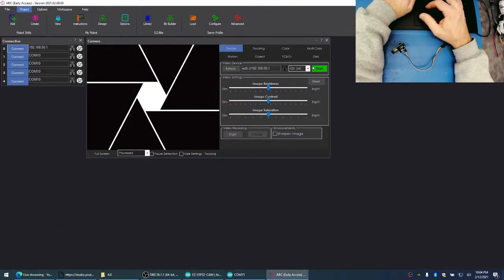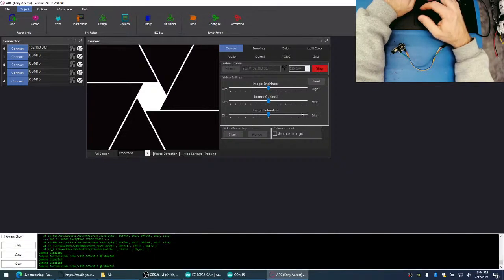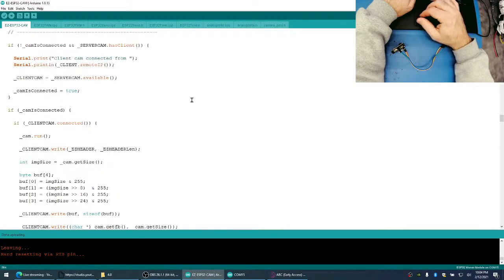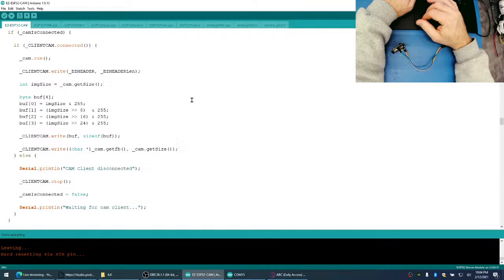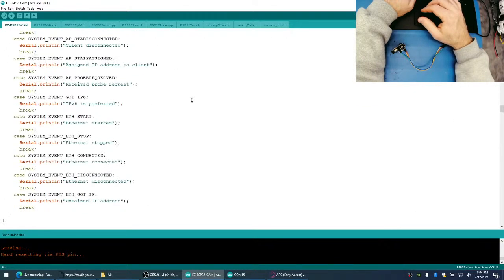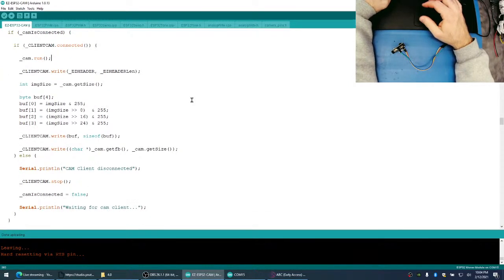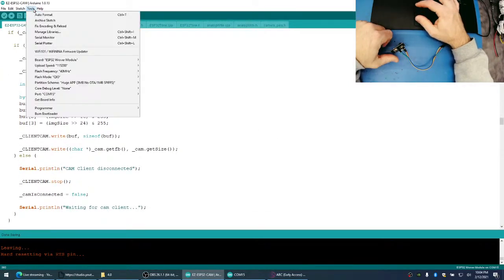It's 133 megahertz, and it's got 264 kbytes of RAM and 2 megabytes of flash. 3 analog ports, 26 GPIO, 2 UART, 2 SPI, 2 I2C, 16 PWM channels, and USB. I don't know what happened here, guys, but we broke this thing.